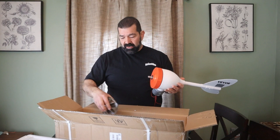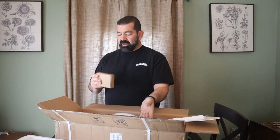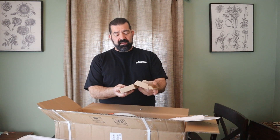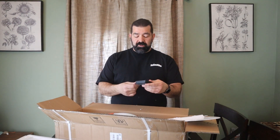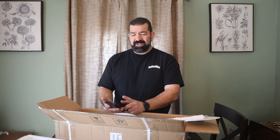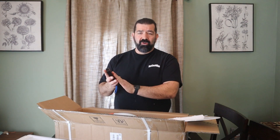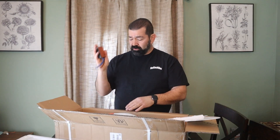I'll look at the instructions and there's a nose cap that goes over the top once the blades are connected. Last is this little box — and it comes with its very own charge controller. It's a small one but it says it's a 30-amp wind controller. I may start out using this but I might end up getting a different MPPT or other type of charge controller. For now I'm going to use what's supplied since this came with it.